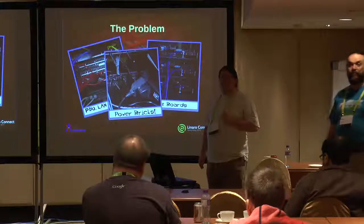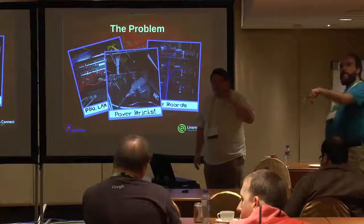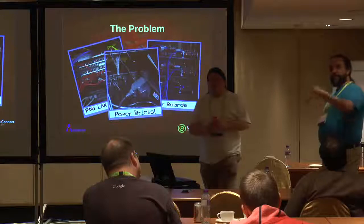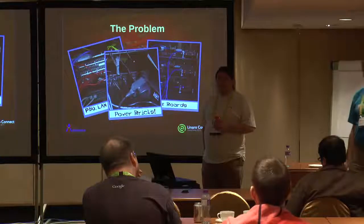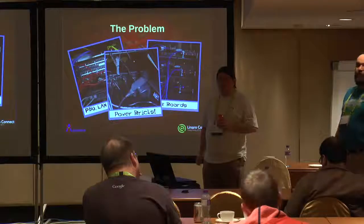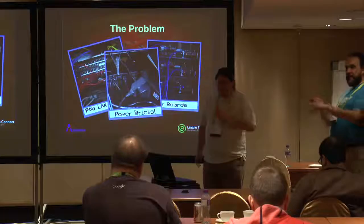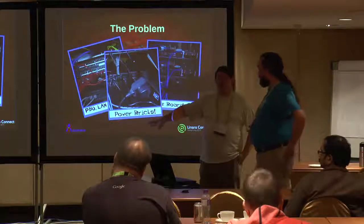So are you planning to incorporate SD-MUX switching capabilities? That's on the EUT side. You'd actually need cables connecting into the device to provide the SD card, so that would be something you would fit to the device. No, I was thinking in terms of the LMP SD-MUX card that allows you to flash the SD card. That's stalled at the moment, Carlos. The LMP stuff, we're looking at a different solution, which probably will be a lot simpler to deploy. Okay, so on this board there are no plans to support that. There's no SD on here to the outside world.